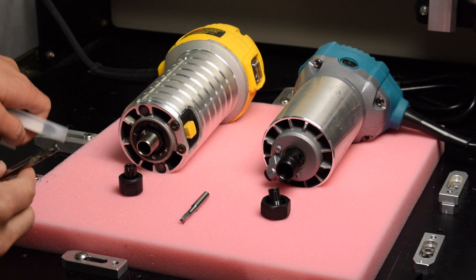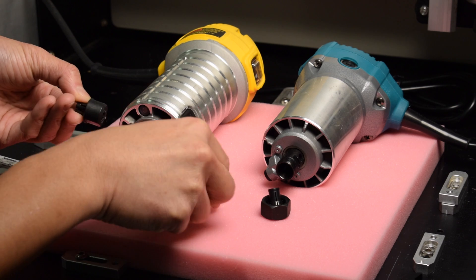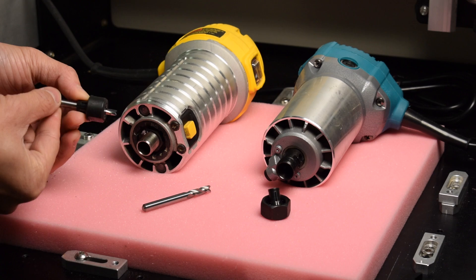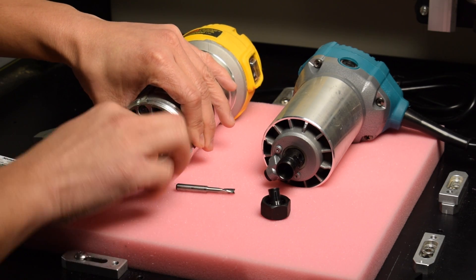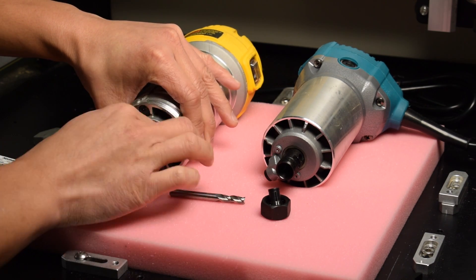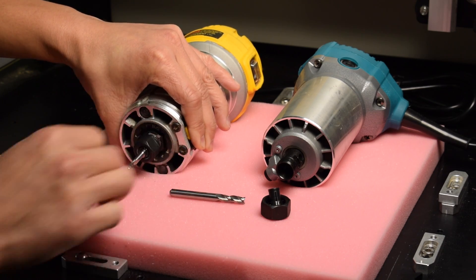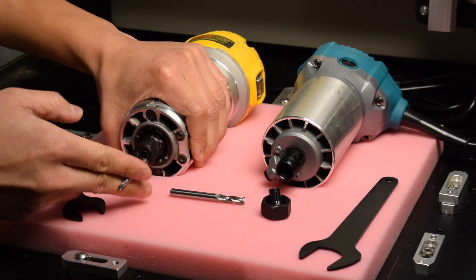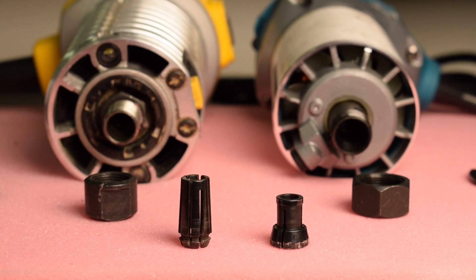Except there are a lot more interesting nuances of foam cutting that I discovered in the course of my experiments. Let's start with where the Datron cutter shines - but actually before we get to that, we need to talk about how you can even use Datron tooling, because it's metric. This one has a 6-millimeter shank, not quarter-inch. Most collets have a compression range to accommodate a small variation in shank diameter - this is the safe range that you can crush them without permanently damaging them. On ER11 collets it's about half a millimeter; on larger collets it can be up to a millimeter. This is partly dependent on the grade of steel used in the collet.